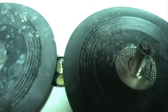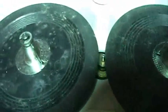Maybe we should go in order here. Here is the appearance of the recorder without reels. You can observe the simple, cheap rim drive method in use. When it's in stop, the motor shaft always touches the take-up reel spool, allowing a notch to be formed when it's sitting there for years unused. When it's in play, it simply switches the motor on. It's adjustable by this speed control. In rewinding, the motor goes a little faster, and the larger diameter spindle spins the other reel tube.